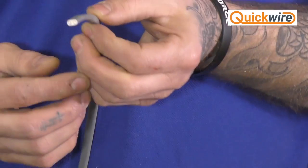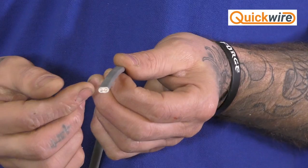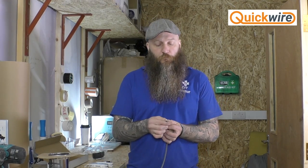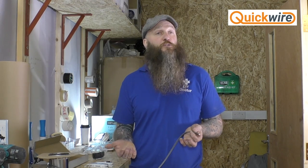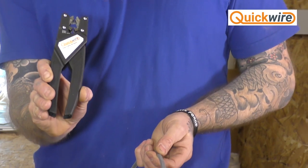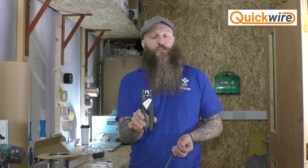The outer insulation needs to go back between 20 and 22 millimeters, and the internal insulation between 10 and 17 millimeters. Now that may sound complicated, and if you've been doing this a long while you may be comfortable with a Stanley knife or wire strippers and can estimate that distance easily. However, for most of us it's not necessarily easy, but Quickwire have produced a very handy tool — a set of flat cable wire strippers — and honestly these are so easy to use it feels like cheating.